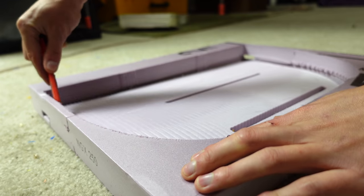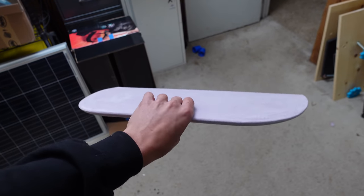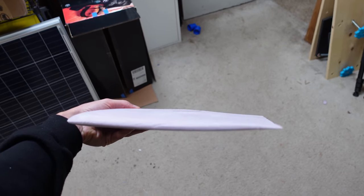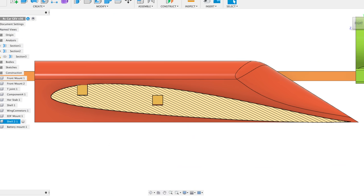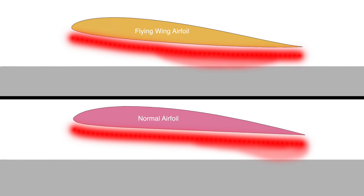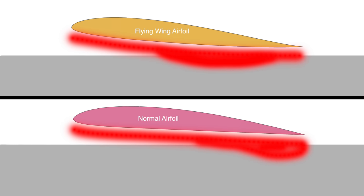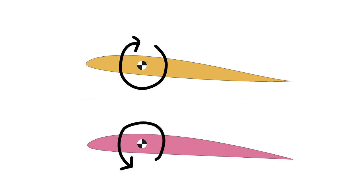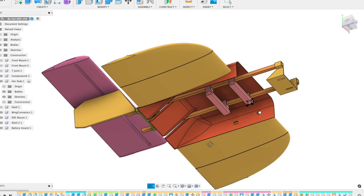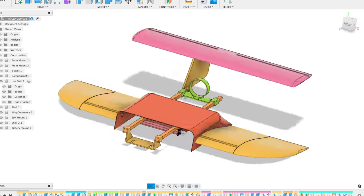After machining, I trimmed the wing out of the stock and sanded it down smooth. I decided to do a flying wing airfoil on the main wing, which means the trailing edge has a bit of reflex to it. I did this because flying wing airfoils are supposed to have a smaller pressure shift when you transition into and out of ground effect, making the aircraft have more of a natural tendency to want to stay in the ground effect. Flying wing airfoils also have a tendency to want to pitch up, so to counteract this I'm using a lifting airfoil on the tail. My design here is definitely a little unusual, and we'll just have to wait to see if it works.